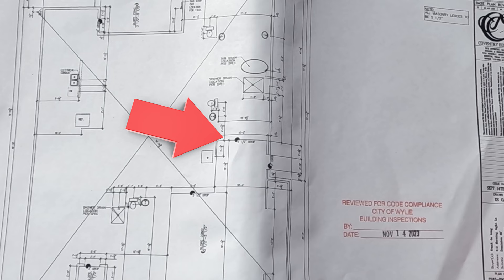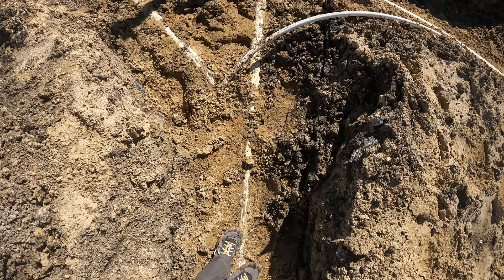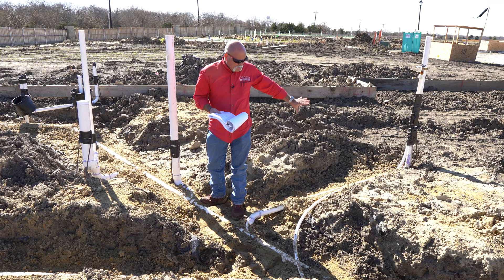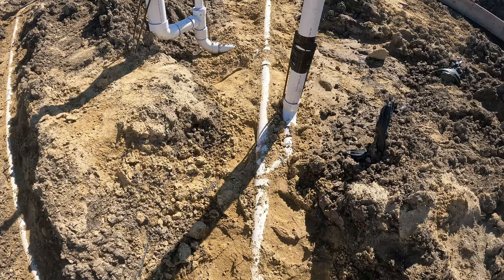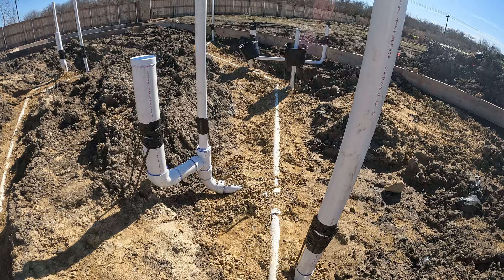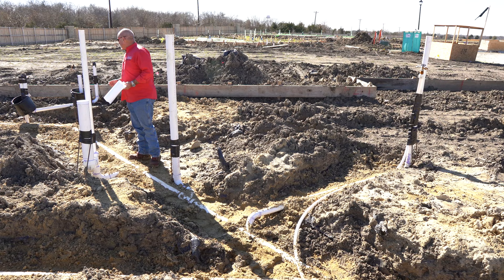From the plans, a branch right here catches the garage. Continuing back, we've got what they call a three-and-a-half-inch drop — really a three-inch drop — going to the upstairs. In the ground here you've got a three-inch Y going off to a bathroom and a lavatory which backs up to the master suite, a laundry room, and a three-inch rise going up for a toilet and lavatory — probably a powder bath off the main living room. This line keeps coming over back into the master bedroom.